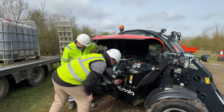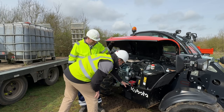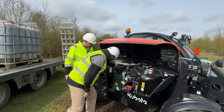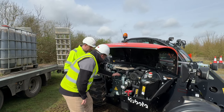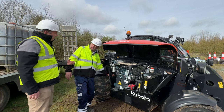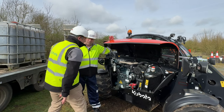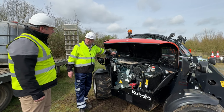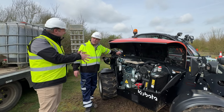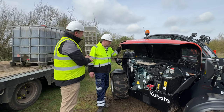And look there — jump posts. I always used to say, why have we got jump posts? It's either because it's over-engineered or the battery's not accessible. But in this case I'm going to say it's over-engineered, because the battery's just down here — we have an access panel, so you can just pull it out. And then of course we've got access to the engine dipstick, oil filter, and we can replenish the oil by the operator. Our fuel system is very neatly located here, and if you put your hand underneath you can actually get your filter socket and take it out. It is really simple to service — even your alternator belt tension, everything. And you see our DPF filter there? 6,000 hours service interval. Quite often the exhaust DPF is hidden in the engine bay, but look how it's exposed. You send it away for its 6,000-hour service cleaning — just a few bolts and off you go.